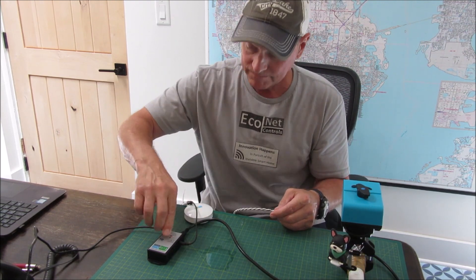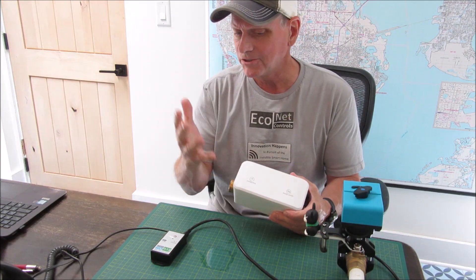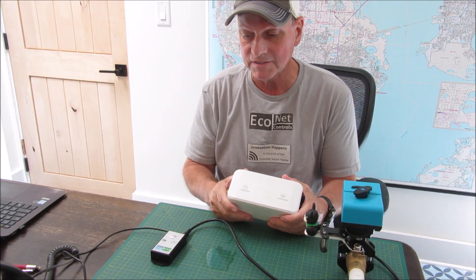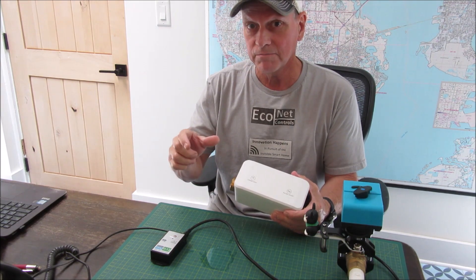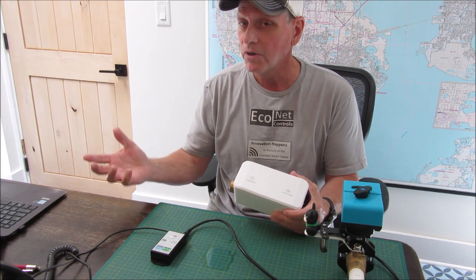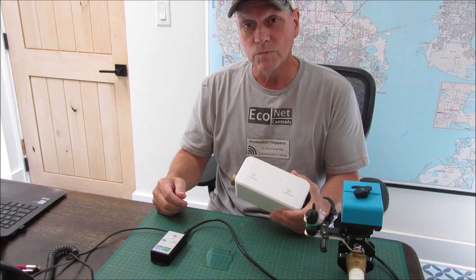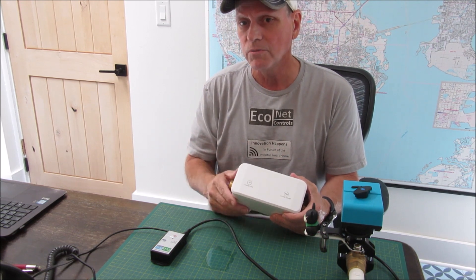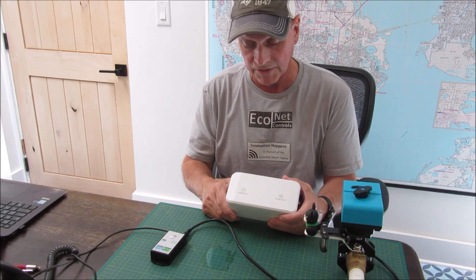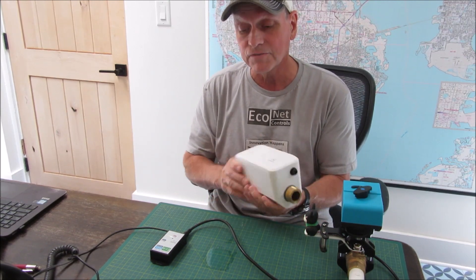One thing: it's wet, it shuts off the water. The wireless puck-style leak sensors — 20 to 60 dollars, available in Z-Wave, ZigBee, 433, and LoRa — are a good solution. You can place a puck in leak-prone locations like the dishwasher, bathroom, laundry room, or near the hot water tank valve. That covers most of what you'd have problems with. But of course they can miss leaks for one reason or another because they're not in the right location, or even when they are, the water could be two inches to one side and the sensor will miss it. So to cover for that, there are flow-based solutions.